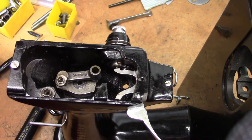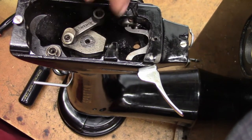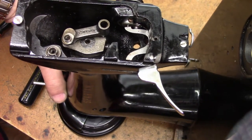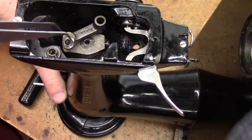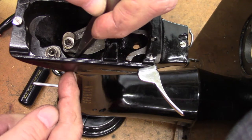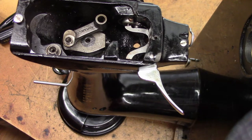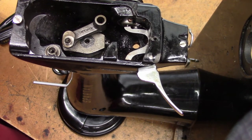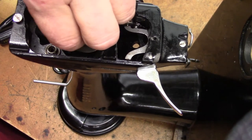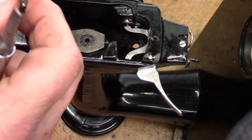There is a hole here. We're going to swing the hand wheel because there's a set screw down here which we're going to access through that hole on the side. This is one case where our fancy gunsmith screwdrivers will not make it in there, so we use a good quality screwdriver that fits. We loosen that set screw, and we can lift out the crank pin and the eccentric that has a ground flat.